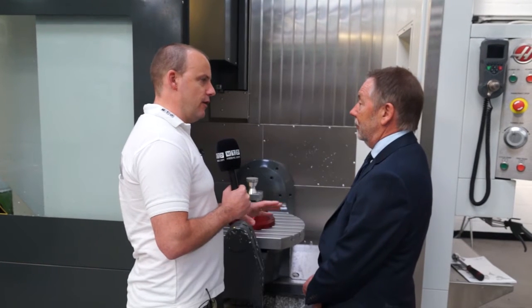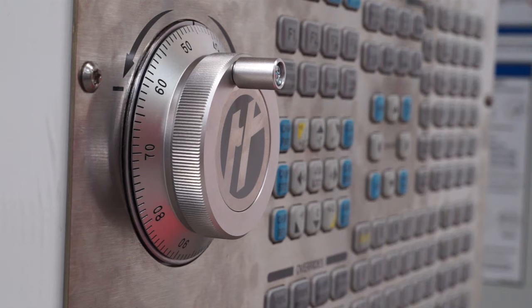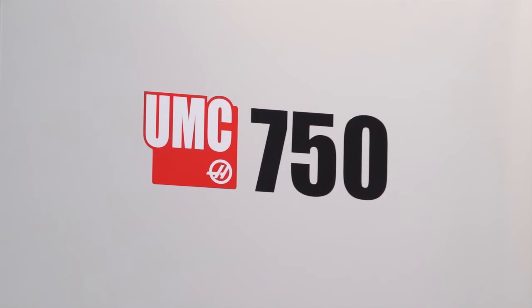What I'm hearing is something very similar to what is known as Cycle 19 on another control system — would that be correct? Yes, it's doing the same kind of thing as Cycle 19. Everybody has an industry name for what they're doing. Tool Centre Point Control does, I think, more accurately control what we're doing with it than Cycle 19.